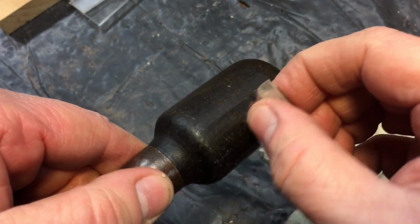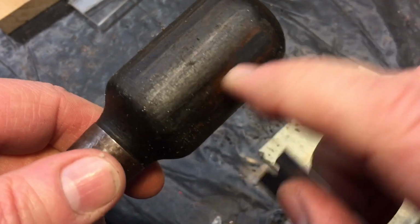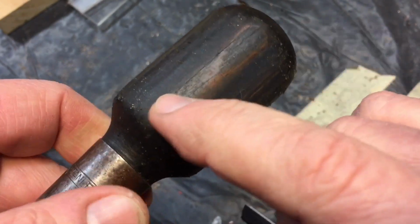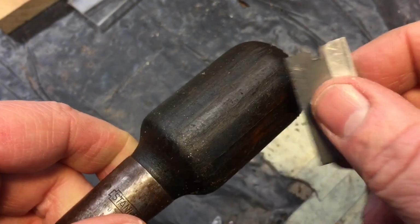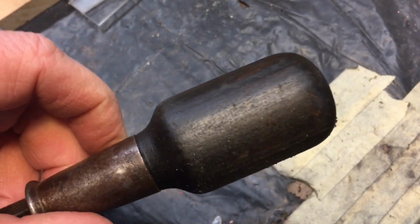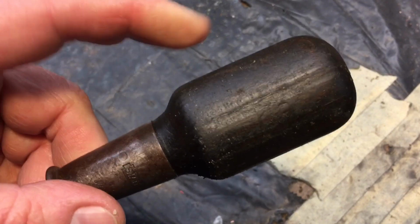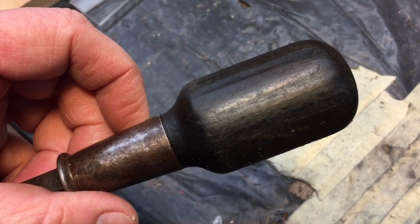Let's get started. Now, normally my first step is I like to take a razor blade and scrape off some of this gook that's on here. The problem is that we do have some residual of these contours that were cut in, and we want to keep as much of that as we can. So I'm not going to use the razor blade. What I'm going to use is paint stripper. Now, paint stripper works just as good on paint as it does on varnish and all these other things, and it should maintain a nice color. So let's do that. A little steel wool and paint stripper.